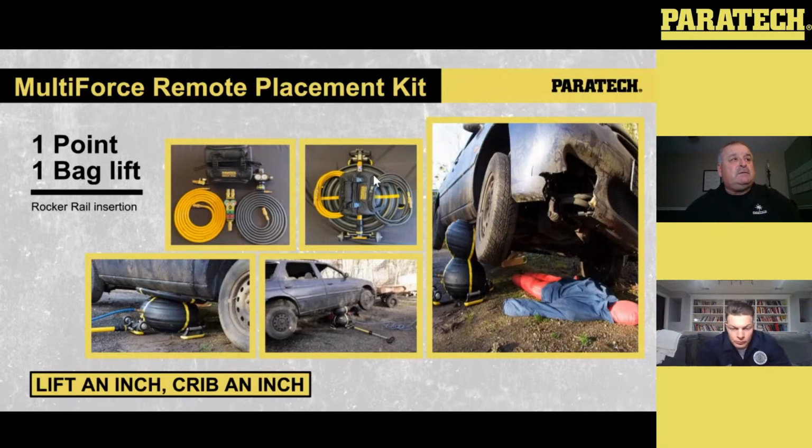And if you take a look at the picture on the bottom left, it shows where the one section is inflated. It's going to inflate the top section once it gets to the appropriate pressure, and do the lift. Whereas you see on the right hand side, it actually lifted the car off. This one was done without stabilization, as you see. It was just to show the height you can go to. But we'd never lift without stabilization. We'd only do this as a demo. And after that demo, we'll take it back down, then we actually lift with stabilization in place.